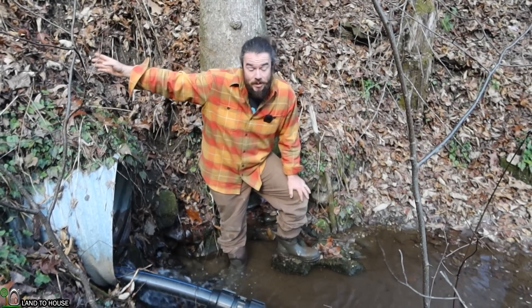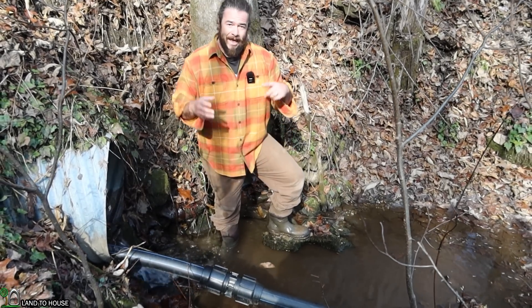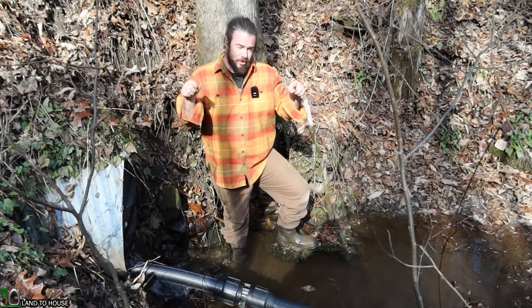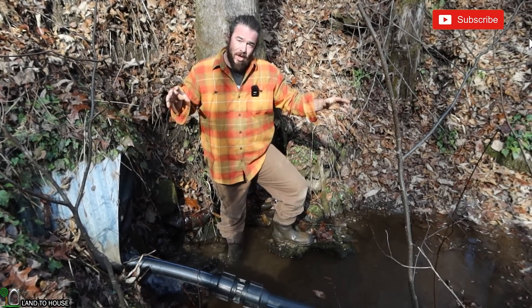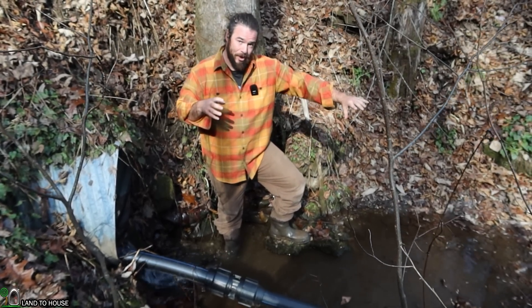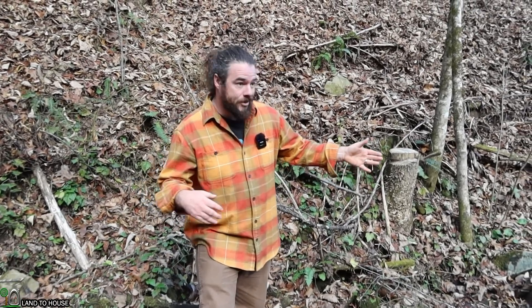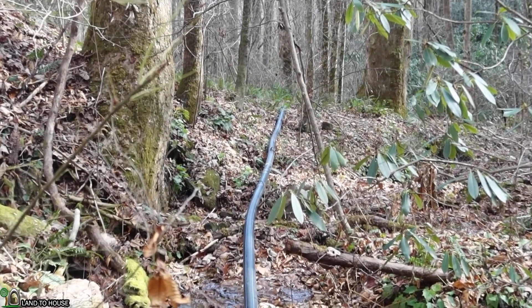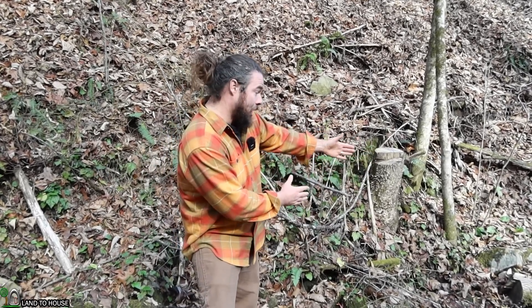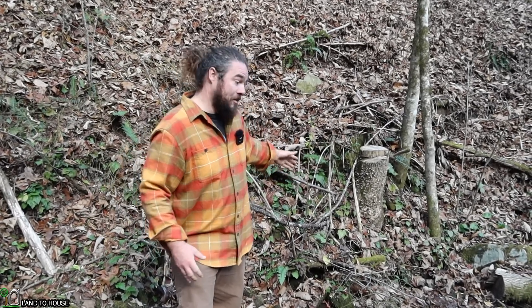I have 500 feet this way and 500 feet this way — this is where they meet. These are a bear to get on. At the end of your penstocks, you will have coils just how they naturally are. You can lay them out in the sun as long as you want and they still will have that coil. You have to cut off a certain amount so the pipe is straight for them to meet. This is a section of pipe where it actually goes uphill. What happened was this summer, I had three inches of rain in one hour, and the pipe — which was tacked up along the side — was just thrown wherever the water wanted to take it. All my tacks and straps were just ripped out.